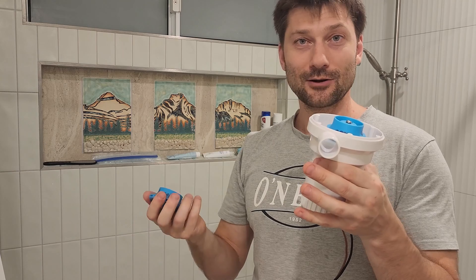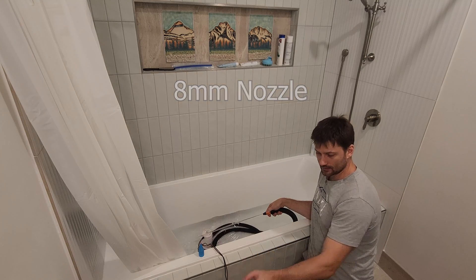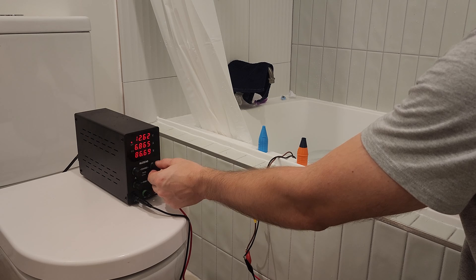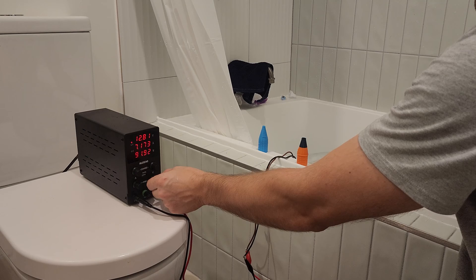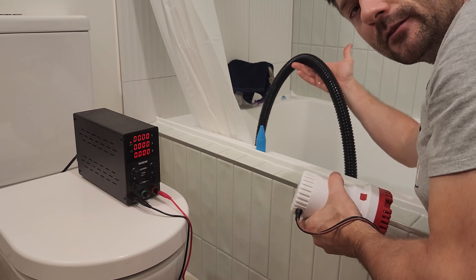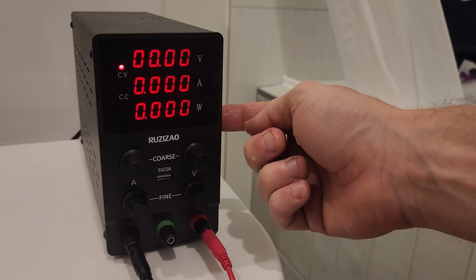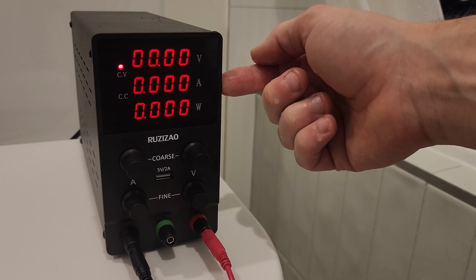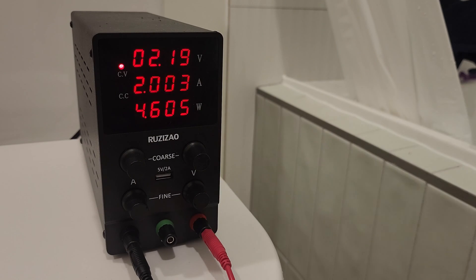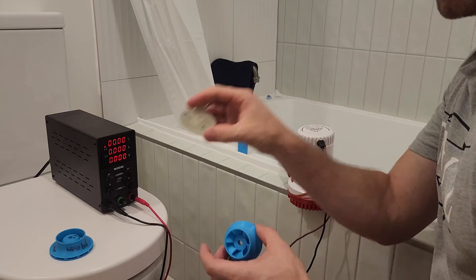I have no idea if my software calculations are actually going to match reality, so I'm going to quickly test this and see if there's any noticeable difference in amps drawn. That's 6.6 amps, 84 watts — that's a lot. Even this two-meter length of hose creates slight resistance, so just to be consistent I want an open number with just the pump by itself. This screen lets me adjust voltage and amperage up to 10 amps and reads the wattage. So: 7 amps, 90 watts with the pump wide open.